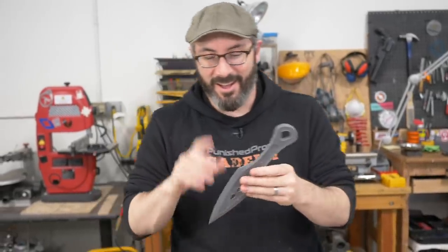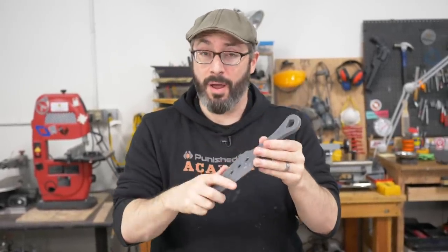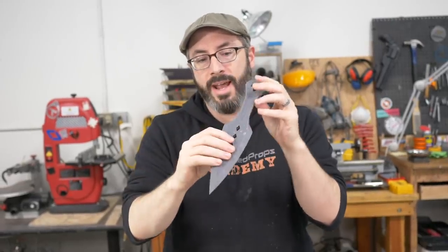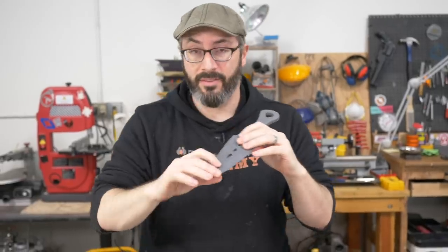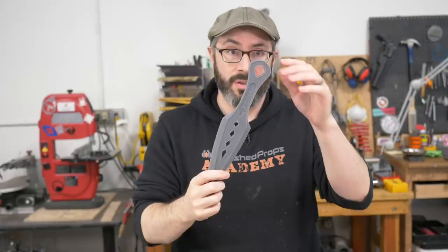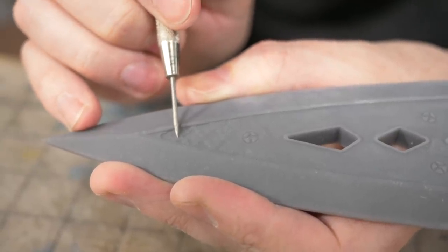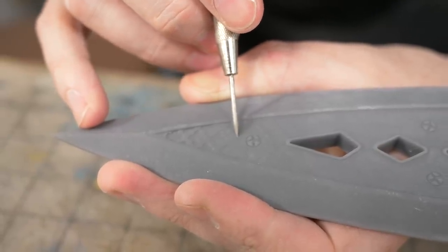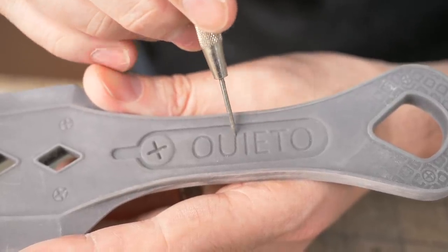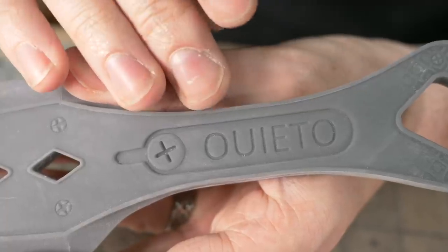This thing looks really great. I printed it with the flat side facing the build surface so the supports would have something to grab onto, although in hindsight, printing it perfectly vertically would have kept supports off the surface and reduced cleanup. Everything turned out really well. The side without support material is blown away in detail — I challenge an FDM printer to get this kind of super fine detail. The text is about a millimeter deep, super clean and crisp. This level of detail on a 12-inch all-in-one print is pretty exciting.